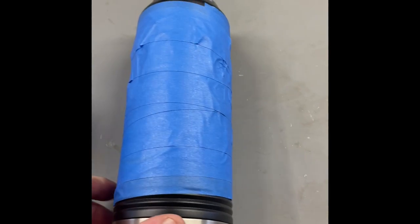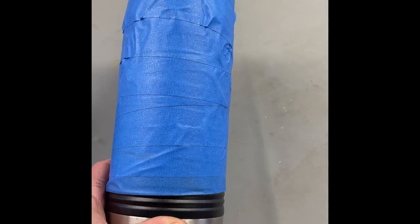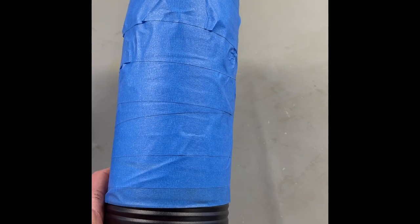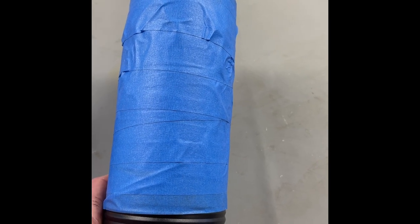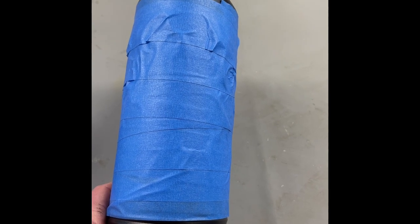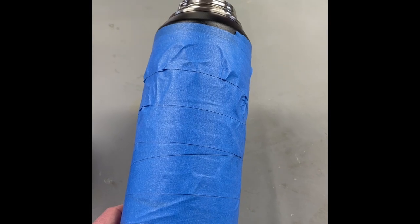Okay so we've never run this image. This is the only water bottle we have, so I have rolled a lot of blue painters tape on it. We'll adjust the power settings and speed settings so that it just marks the blue painters tape, but this will give us an idea of what it's going to look like before screwing up the only water bottle that we have.